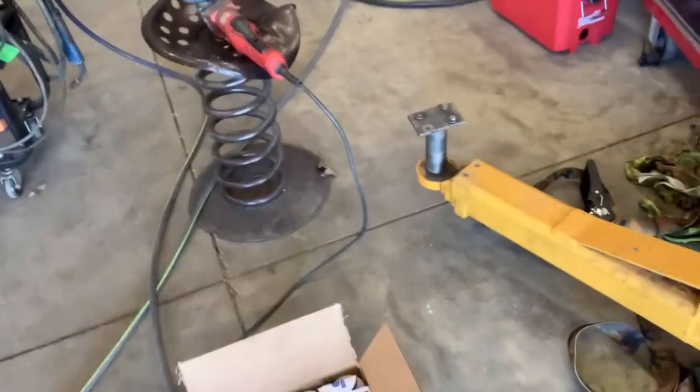And now I got this whole box of Steel It gray. I think a lot of people think it's just overpriced spray paint, and maybe it kind of is, but most people just don't understand that you have to let it cure for like a week for it to harden up. And they spray paint it, and 24 hours later, they go to use it on something, or it gets dragged on something and it scratches, and they're like, well, this is just spray paint. And it's like, hey, you got to let it cure for a week.